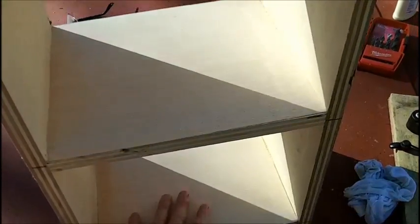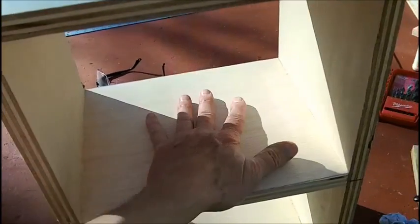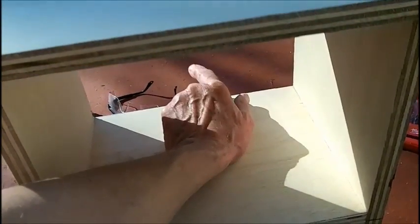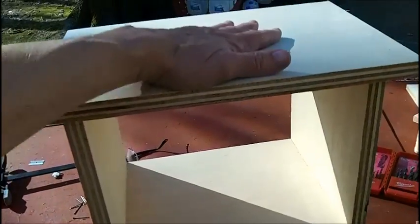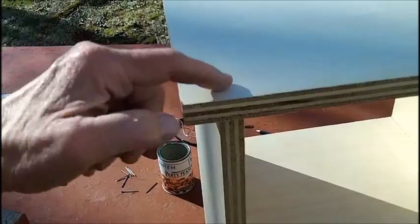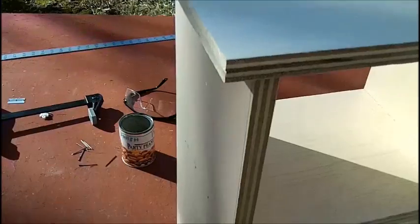And he can put stuff here and here, and there'll be a back on here. If he wants the CPAP machine here, I could drill a hole for the power wire in the back of the quarter inch Luan that I'm going to put on. So the next step is to mark, in very light pencil, on the face of this, and drill like I did before and nail it in.